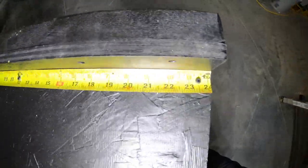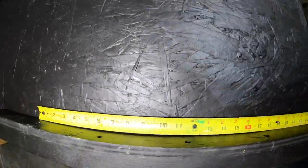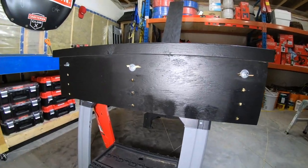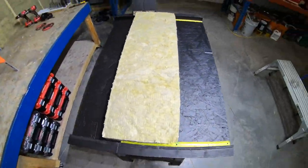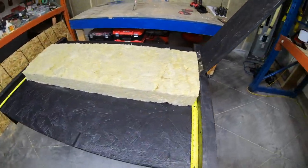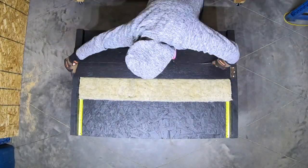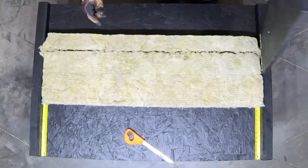This insulation sled is going to save me so much time. And like I said, my least favorite part of insulating walls is cutting all the pieces. Now let's test it out. Place insulation bat on 12-inch line. Check other end. Close knife guiding fence on bat and start to cut. Once you feel the blade is through, open guiding fence. It's that simple.